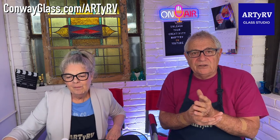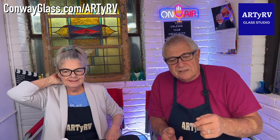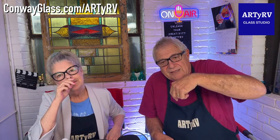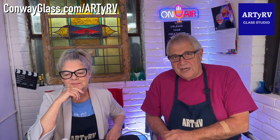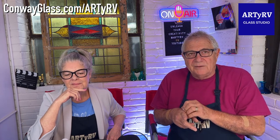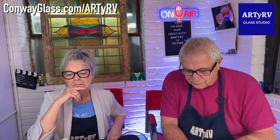Once the glazing goes on the window, allow it to sit for 10 or 15 minutes. Go around it, clean the edges of the glazing from the lead to the glass. Then come back and polish it with an acid brush, flip it over and do the same thing on the other side. Then you can allow it to sit for a couple of days and come back and clean it before you do the final install.